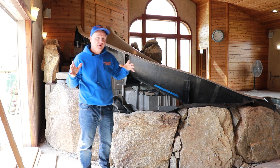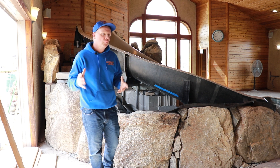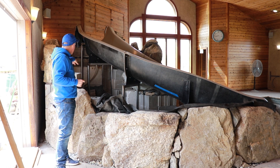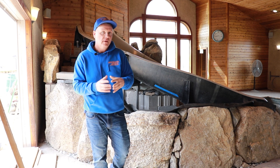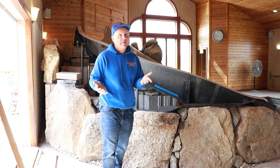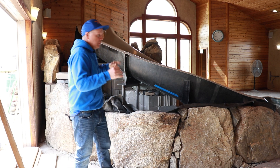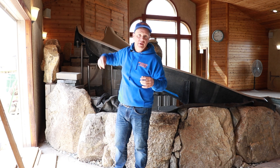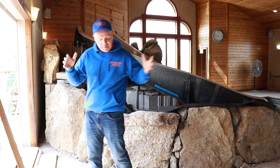What we do is, in certain scenarios, we use an expanded EPS — expanded polystyrene — which is a structural foam. We use that in certain environments. See all that white foam there? That is big, huge blocks of foam, and where we use it is in areas where we need structural stability but we don't want the weight of rock or crushed stone. Crushed stone works, compacted stone works awesome as a base, but it's very heavy. So, this is an interior environment and we used it because it was very tight access. We would have had to bring in 60 tons of material, so we used the foam instead, because it's much easier to get into the space, and you don't have to compact it because it comes in blocks.